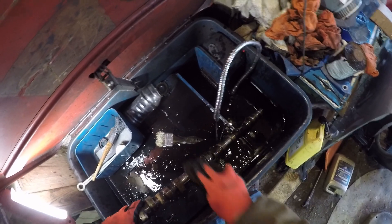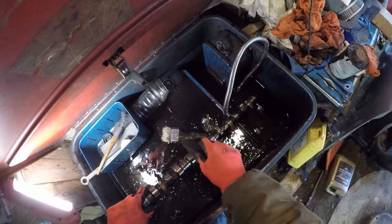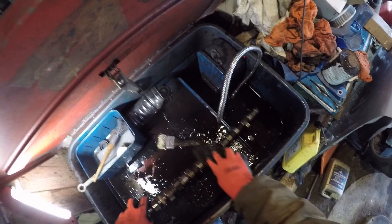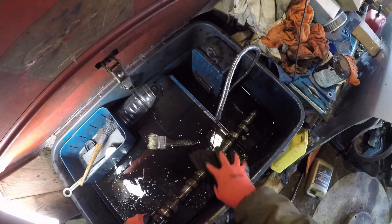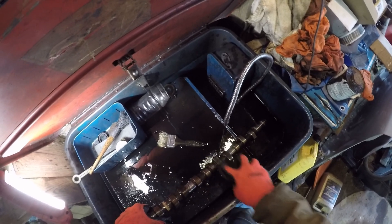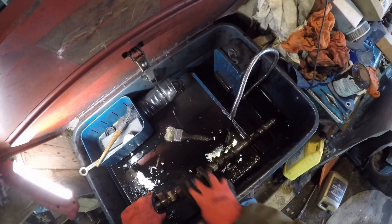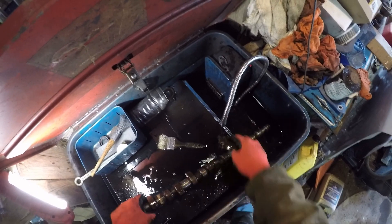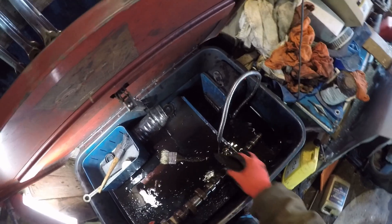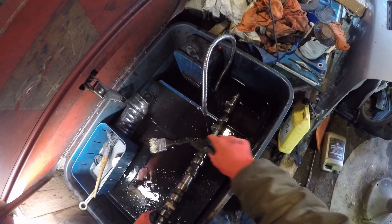Cleaning it at Diesel Dave's parts washer with probably a 50/50 mix of diesel and gas, and I also poured in about a gallon of kerosene just for good measure. I'm working it down with a nylon pad right now — don't want to use anything too abrasive. You also want to be sure to go in the direction of rotation; don't want to put cross-hatching on there.